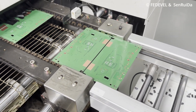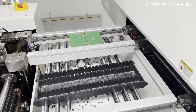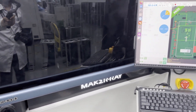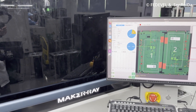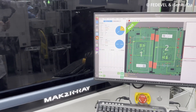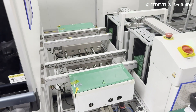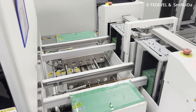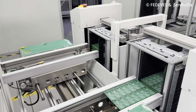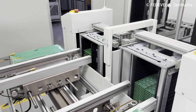At the very end of the oven, the PCB will cool down. At this point, components are soldered down and the PCB goes into the last machine, which is AOI — automatic optical inspection. Based on reference pictures, this machine can decide if all the components are soldered correctly. The last machine in the line is often a sorting machine that sorts PCBs based on whether they pass or fail the optical inspection.